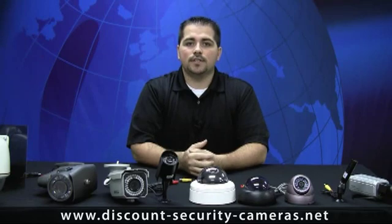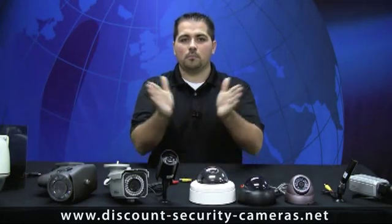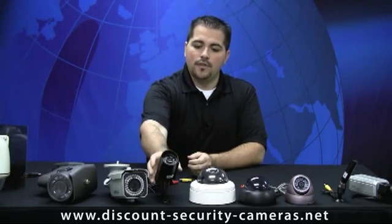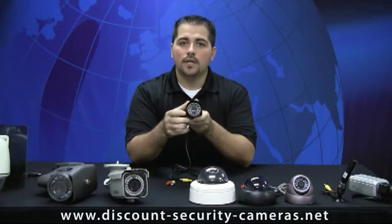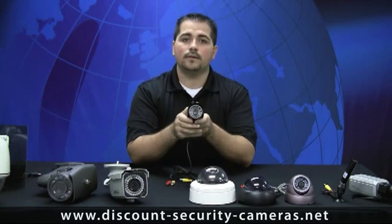Now we're going to bring you into the larger bullet cameras with a little more infrared or night vision range. These cameras have a tuned IR that works kind of like a flashlight — your IR can be available anything from a flood to a spotlight, so it's important to get the right lens when looking at a camera. This camera here has infrared LEDs and a lens right in the center. During the day, this camera stays in color, but at night, or when the lights turn off, the infrared LEDs turn on and the camera sees it as natural light. Because the camera has a photo sensor, the LEDs only run as needed.